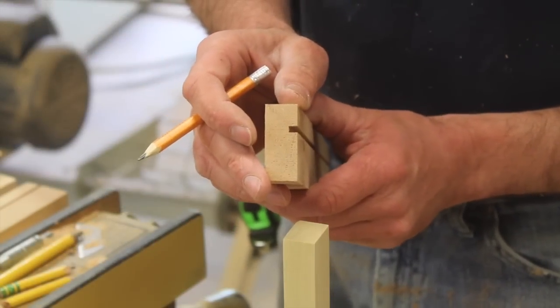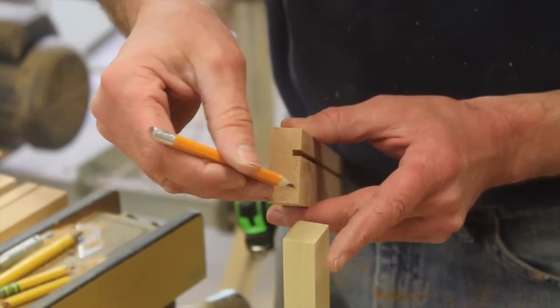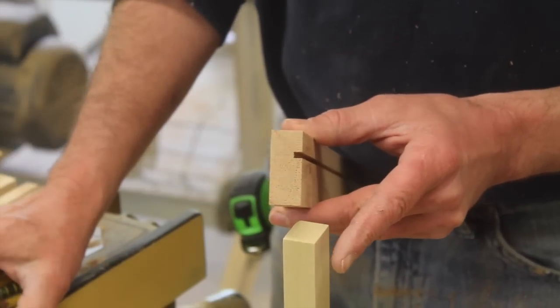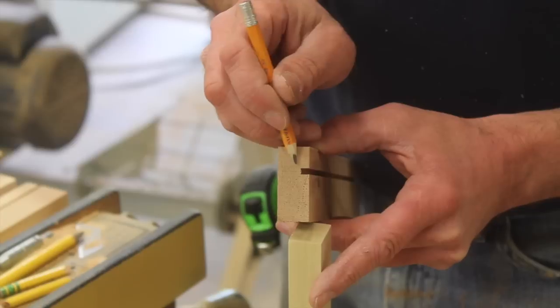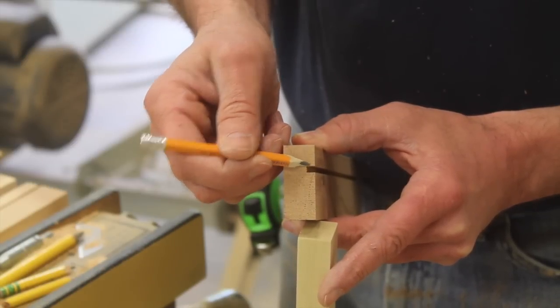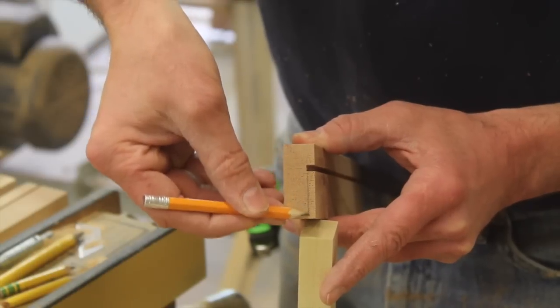Since I've made the first cut in all of the molding, and I want an eighth-of-an-inch rabbet and my stock is three-quarters of an inch wide, I've set my fence at five-eighths of an inch. I've raised the blade so it falls somewhere in the middle of this curve — I don't want to cut into this side of the molding. Basically what I'm doing now is cutting this part away.